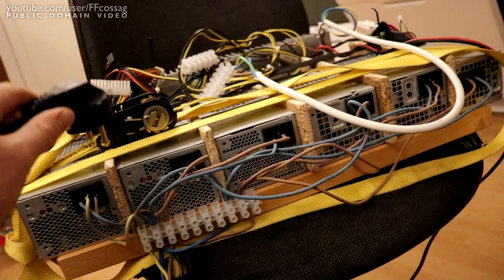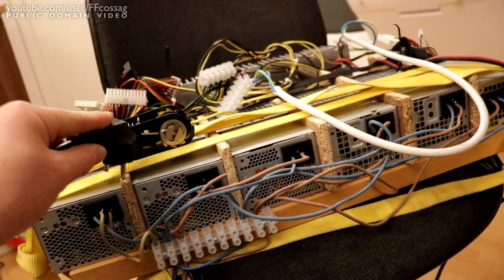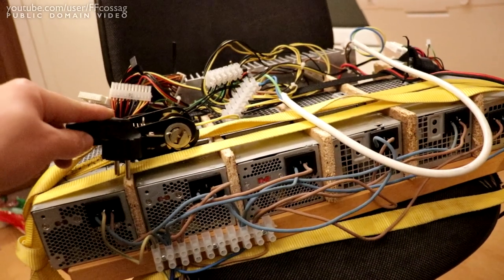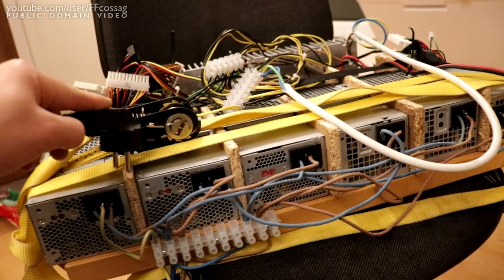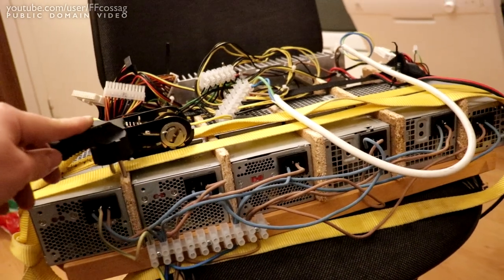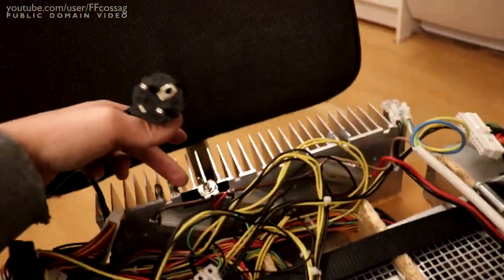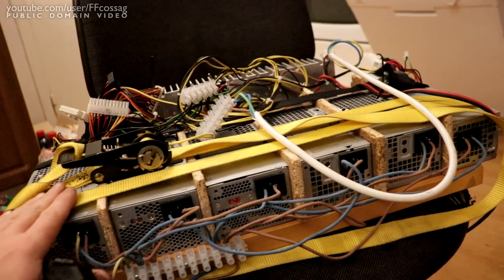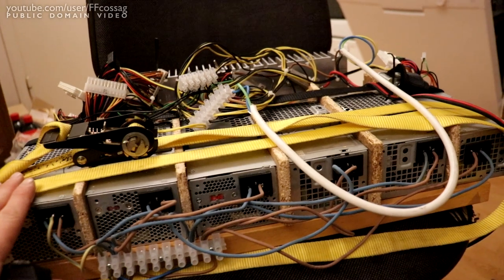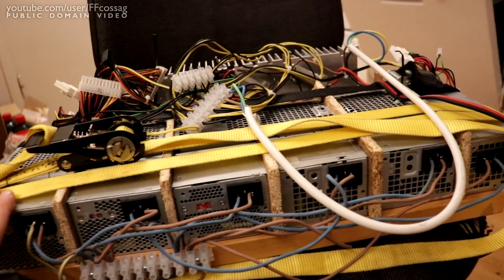Now, power output of this thing is pathetic. 14 amps is, you know, just over a kilowatt. As soon as the battery gets slightly charged, where last I had it out before taking it in to do some modifications, it was sitting at something like 66 volts or so, and this thing was putting out, you know, 7 amps. That's where I added the extra resistor there. So this thing is dog slow, you know, a couple hundred watts, if we're talking about 600 watts when I took it in, it was doing about 800 watts when I started.